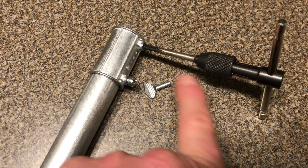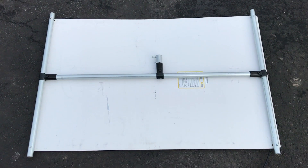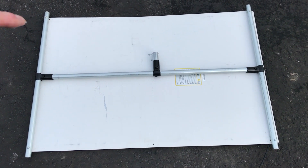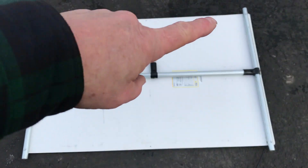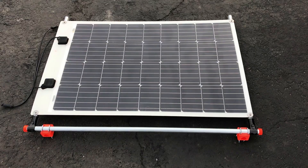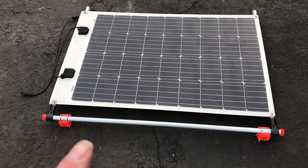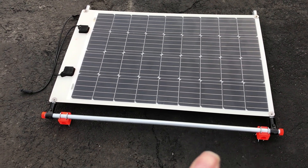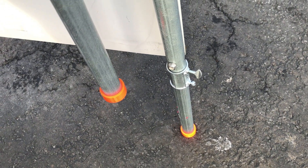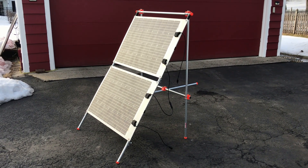I'm just cleaning up the thread with a 10-24 tap so that the thumb screw will fit in better. I'm using EMT and the Maker Pipe connectors, so each solar panel has a pipe along the outside edges and then one down the middle, so it's like the shape of an H. The top panel has an extra bar that goes across with two sliding crossovers that have wing nuts on them that can be tightened. The front extension legs will just come off by undoing the thumb screw. Here you can see the two panels folded out in sort of a winter angle.